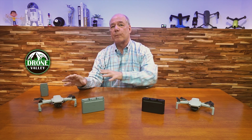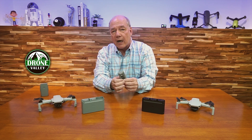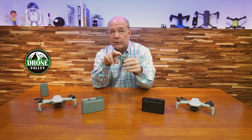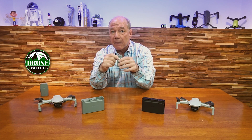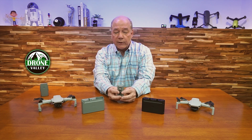DJI is not selling you naked LiPo packs like FPV drones that use bare battery packs requiring a smart charger and manual control of current, voltage, and cell size. With DJI batteries, you don't have to worry about any of that. DJI has built a lithium polymer battery pack with a built-in controller that guides the energy going into the battery, balances it across the cells, and protects it from over-current, over-voltage, short circuits, over-drain, and temperature variance.